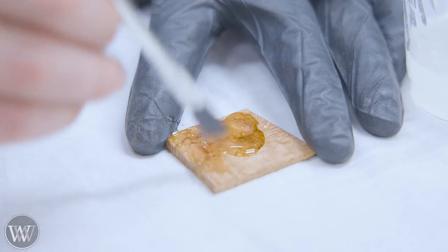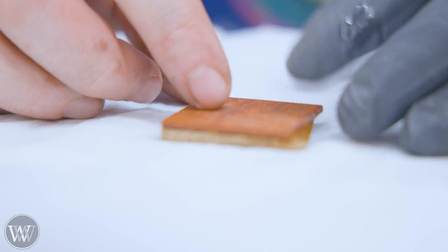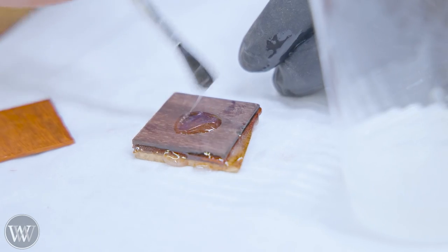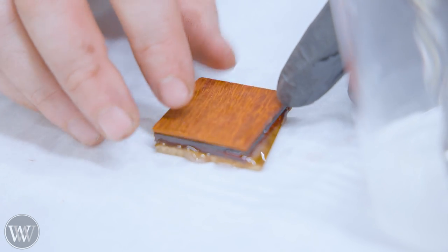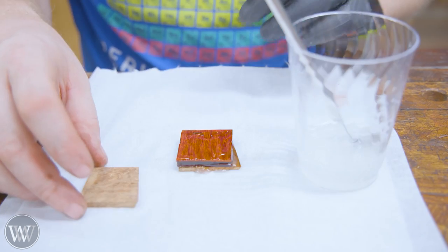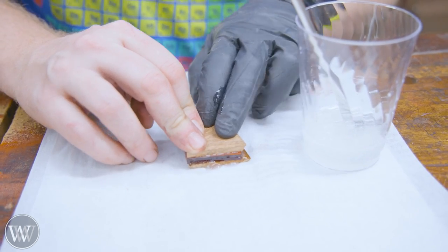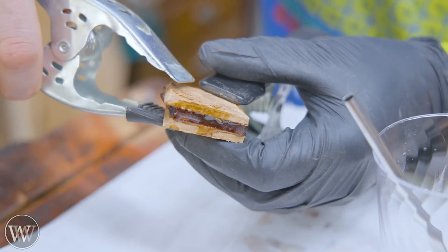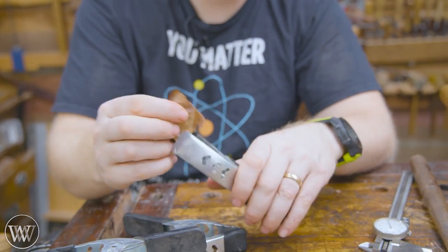The nice thing with epoxy is we don't have to put a lot of pressure on it — we can put a decent amount on there, but we don't have to crazy crush it down. So we're going to do white oak, then Padauk, then Blackwood in the middle, and then reverse them from the other side — Padauk and then white oak on the outside. I wasn't quite sure how these would go together because eventually the Padauk turns brown, but it will never be quite as dark as the Blackwood and never quite as light as the white oak, so there should always still remain colored layers. We're going to sandwich these together, put four squeeze clamps on, and let it completely and fully cure. I actually let it sit for two weeks and there is our block.